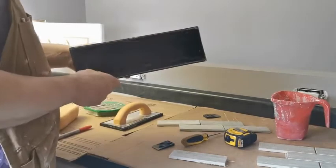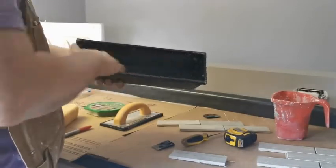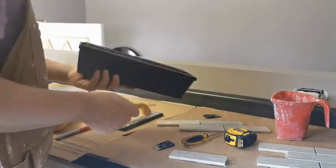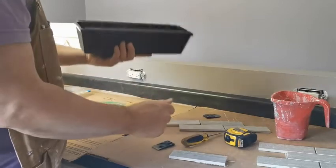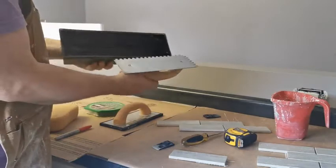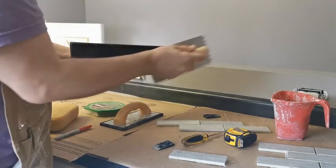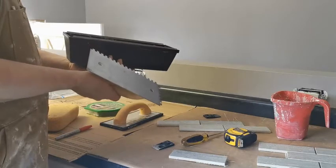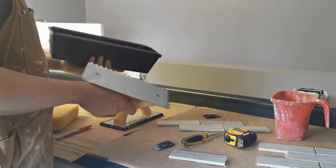I use this little contraption here that is for drywalling. So you put your drywall mud in here and then you apply your drywall. It's got a nice little sharp edge along the top to keep things clean. I like to use that with my trowel because for me, I can work in small little batches in small little areas. It might take a little bit longer for me to do, but when you're not very practiced at this like I am, this was a nice little tool for me.